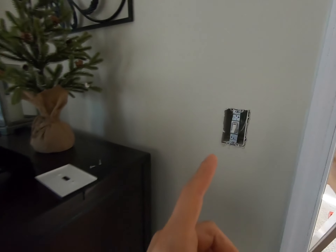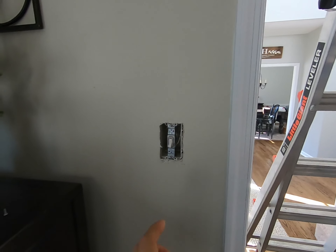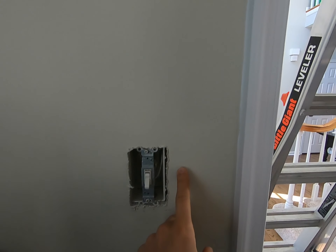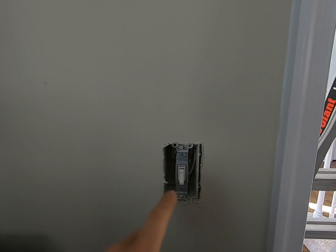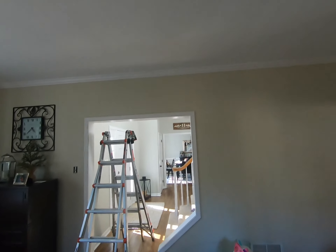What we're going to do is switch to a two-gang box. I know the stud is sitting right there, so I have room to cut the drywall, add a two-gang box, do the wiring, and end up with two switches.